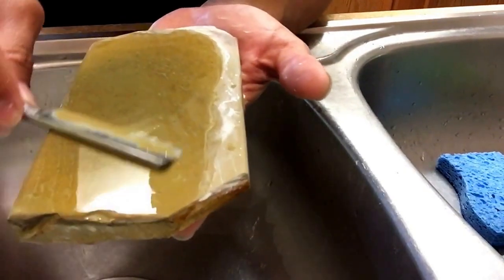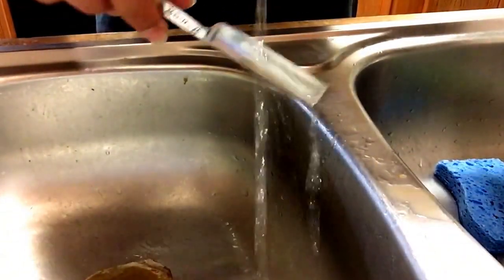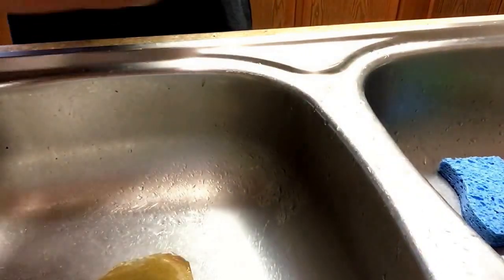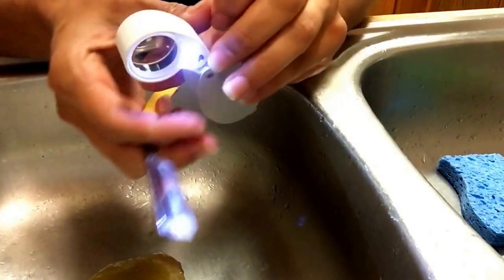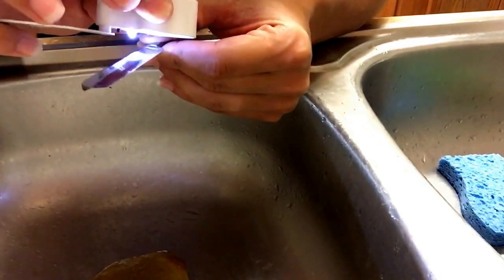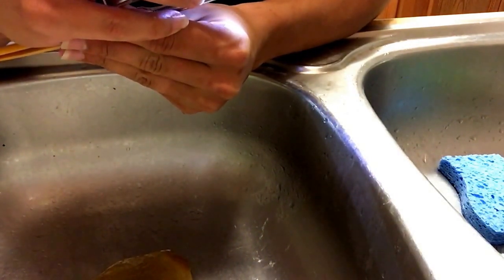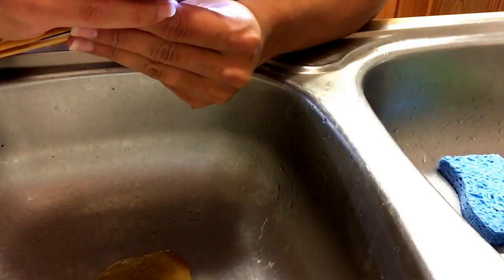And it's feeling awesome. So what I'm gonna do now, this is what you need. You need to make sure that those scratches are gone, the 1K scratches. Right? And the beautiful thing about the JNat, Japanese natural, is that it will leave a very nice bead blast finish on your edge. So you're not getting scratches per se, at least at 40X, you won't see. All I'm gonna see right now, or I should see, I'm hoping, is just bead blasted, and then perhaps one or two light scratches that have survived the hone.